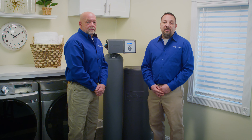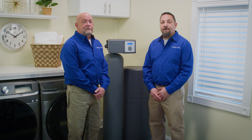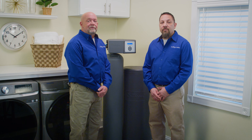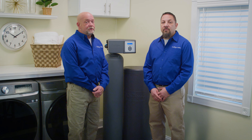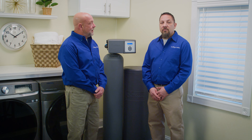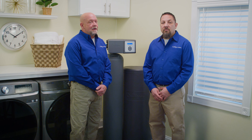So Jeff, are there any potential issues to watch out for when it comes to your salt? Well Robert, if your water doesn't feel soft, it likely means you're out of salt. But if you don't feel soft water and you still see salt in your brine tank, you could be having an issue called mushing or bridging of salt in the bottom of the brine tank. If that happens, call your Culligan professional for guidance on what to do next.